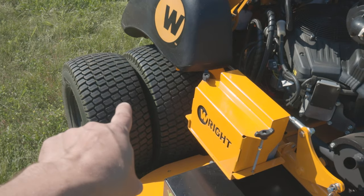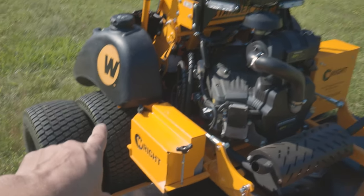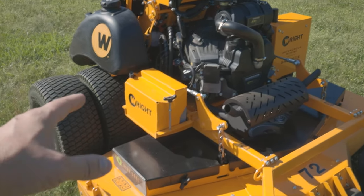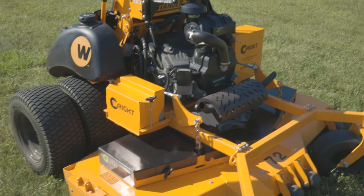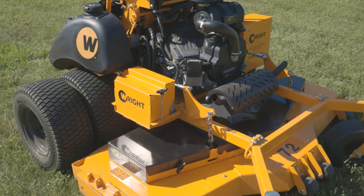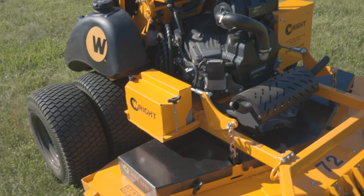This particular machine has duals on it and a weight kit under the platform. The duals are not part of a standard autonomous mower — that's an upgrade for a regular mower, as is the weight kit, so this is experimental. So far we see it only helping the autonomous mower do more things. I wouldn't buy an autonomous mower on the premise of putting duals on it yet, but you're certainly welcome to buy duals and run them with it.